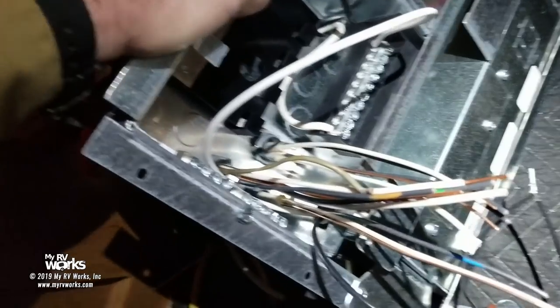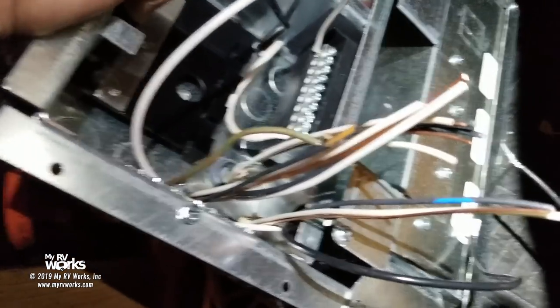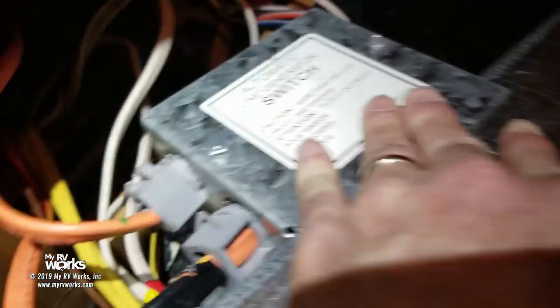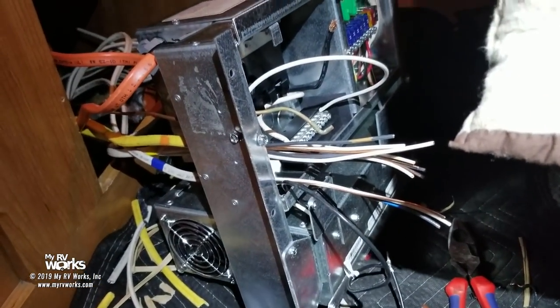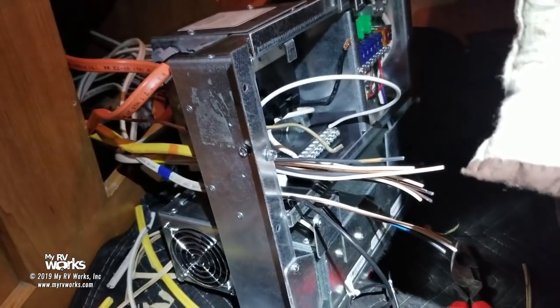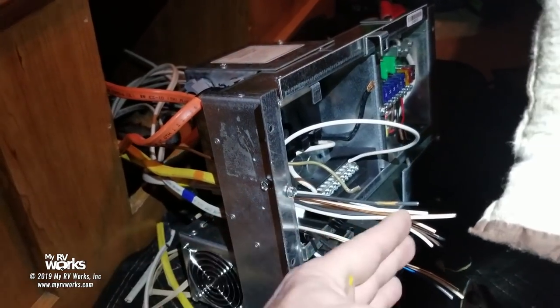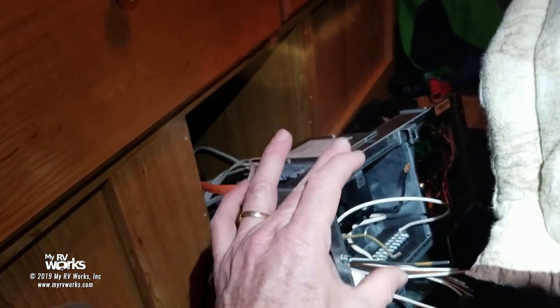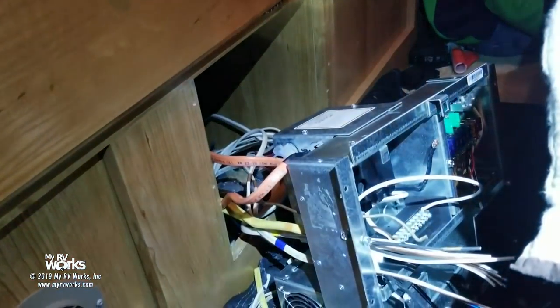With the new panel buttoned up against the wall, DC done and all Romex wires sticking out, the question is: how tight do you tighten the screws? That's what started this whole problem. The panel cover says line terminal, neutral, and ground are all 35 inch-pounds of torque. I always start with ground conductors first — ground is the most important — then neutrals, then the black wires to the breakers. Ground, neutral, black: all at 35 inch-pounds.